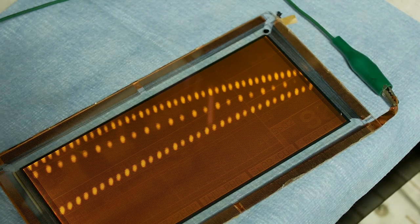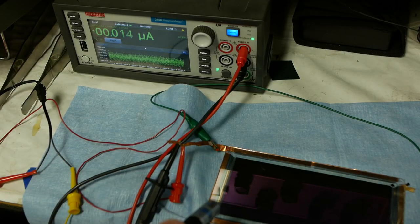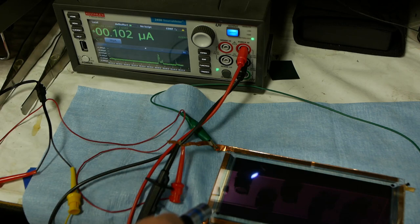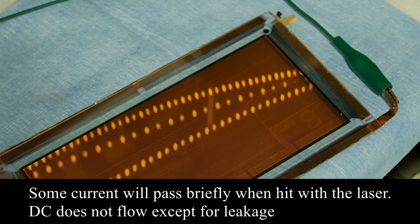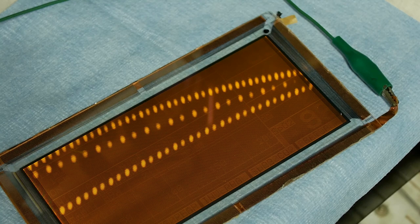As I mentioned, it is running on AC. Let's talk about why you would not want to build a panel that runs on DC. I tried it — not knowing very much about plasma display panels, I hooked this up to a DC supply, and no light comes out. Laser pointer or no, you will not get any light out of this panel, or no current will flow when you put DC on it. So let's talk about why you would not build a panel that runs on DC.